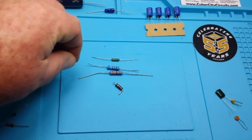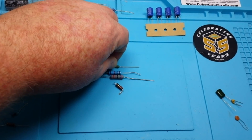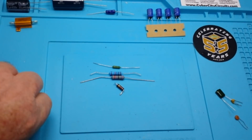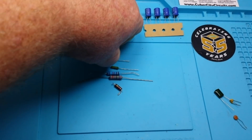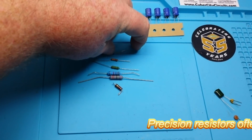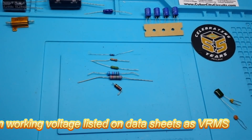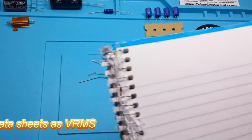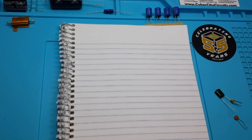You can see resistors come in all different sizes. These big ones are two watt, that's probably one watt, that's a quarter watt, and that's an eighth watt. By applying Ohm's law we can tell what voltage our resistors will be at their highest rating.